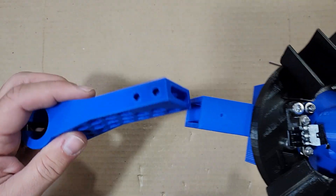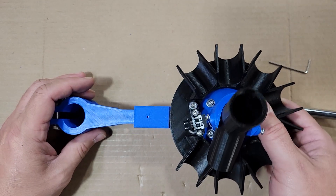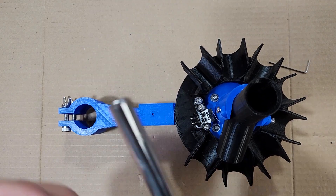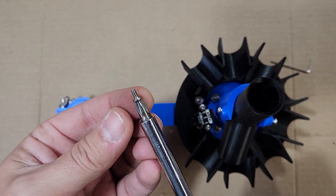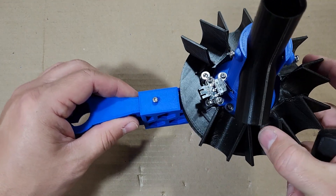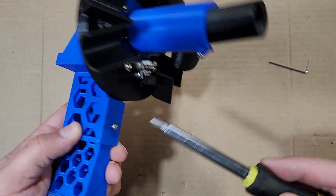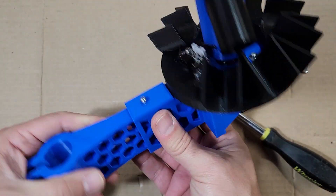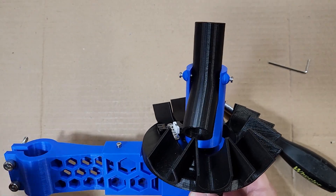Finally, add the pole mount into the sorter base bracket and add a tension screw since the fit is pretty loose. The tension screw is just an M3 by 10 — a short screw; an M3 by 7 would work as well. Don't tighten it too far or you'll put a dent into the bracket, and when you try to adjust it'll want to slip into that dent at the wrong position. Just enough so it's touching the surface and doesn't slip. And that pretty much completes the build of the sorter. Thank you for watching.